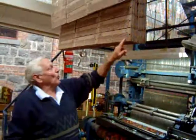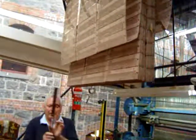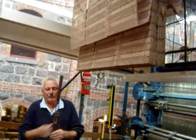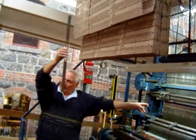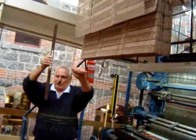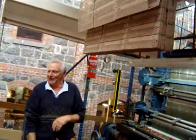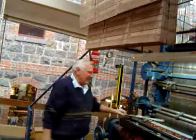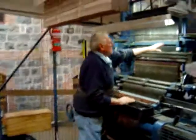So picture this in your mind's eye, we'll see it in a moment. All those blanks all the way across are pushing on needles. The needle in turn pushes out the colour peg opposite. Our straight edge lifts them up. They go up in the air too because we're joined together by a wire. Then up go the grippers to grip. The knife runs across and cuts. They then cancel out. They drop straight back down again, waiting for our next row. That's a 200-year-old technology. It's brilliant, isn't it? We're going to have a look at it.